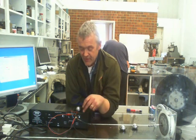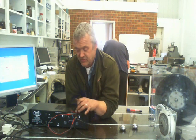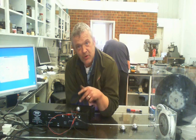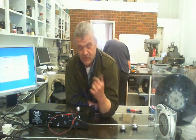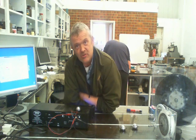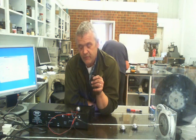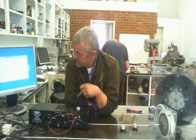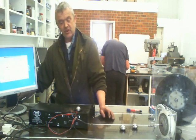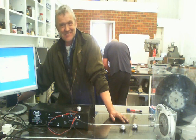In line with what I was chatting about on the board, I've left the two connections to the amplifier as was, but between the other two I've put a capacitor — a 400 nanofarad capacitor. It's connected to the live and the free leg; connected to the free leg and neutral instead, it would have spun in the opposite direction. This motor wouldn't run at 50 hertz with the capacitor — I actually had to bring it down to 45 hertz because it's frequency dependent. Now if I start the signal generator again at 45 hertz, you should see the motor just start running all by itself. And there we go — it's now self-starting. That's kind of cool.